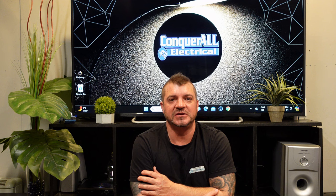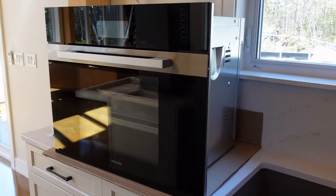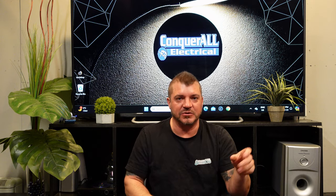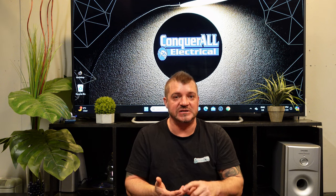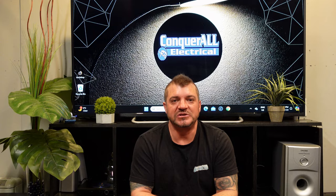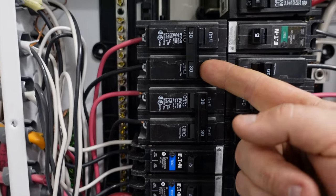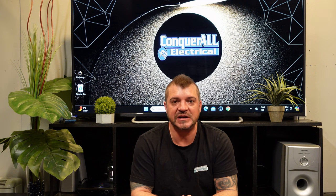This is where the consumer should pay attention. If you have a wall oven or a cooktop — the separate wall oven and separate cooktop in your home — through the 70s, 80s, 90s, and even early 2000s, these were typically wired with 10 gauge wire or 10-3 conductor, which is rated at 30 amps. You can look inside your panel and see the 30 amp breakers or 30 amp fuses. These will do up to 7,200 watts maximum.